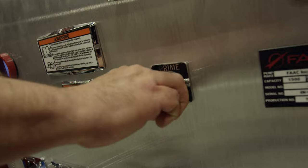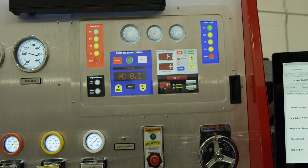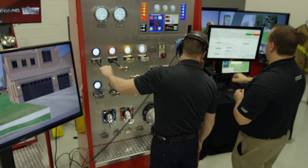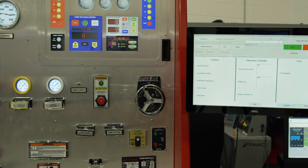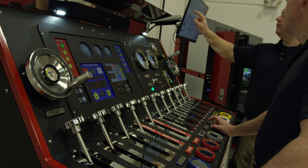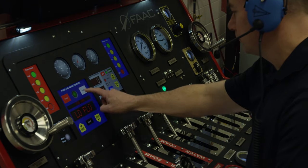Instructors can change all the values — most can be done on the fly — from hydrant pressure and volume to the diameter of both the hose and nozzle tip, allowing the student to use their formulas in real time to calculate the amount of pressure needed to provide adequate flow and pressure to the attack teams. Even friction loss can be simulated for both above and below pump grade.